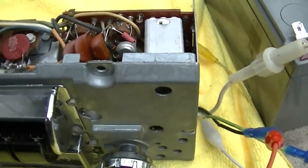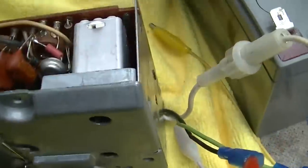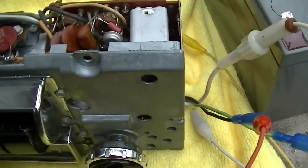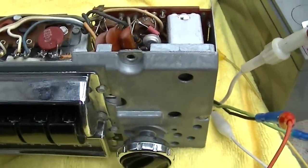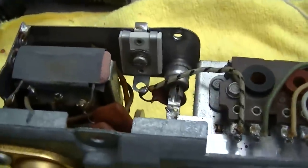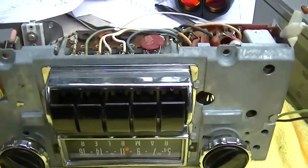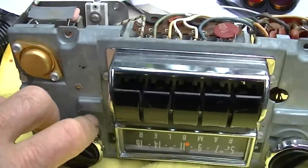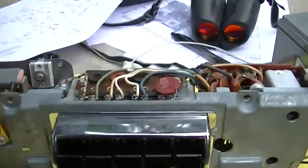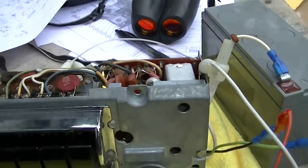I'm considering doing an alignment. Maybe I should put a quick alignment on it because this transistor probably has a different internal capacitance than the factory one, which was a 2SA72 — a Japanese transistor. We'll take a look at the alignment and then put it back together and do our channel sweep. It is picking up KNX with no antenna, which is exactly what I would expect. Let's take a quick peek at the 262 kHz alignment and go from there — I don't think it'll be far off but I should check it.